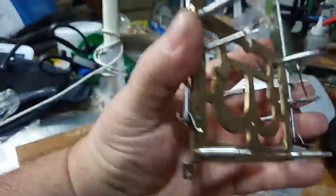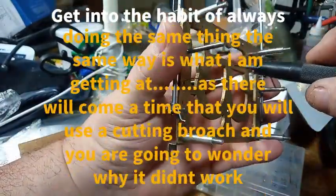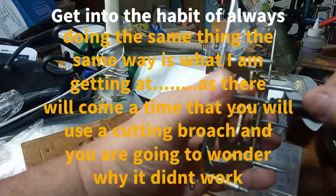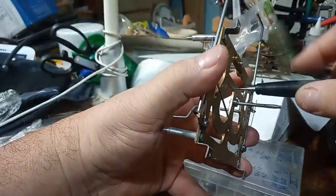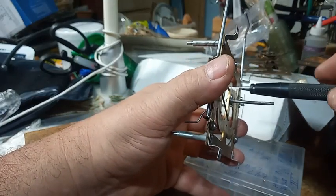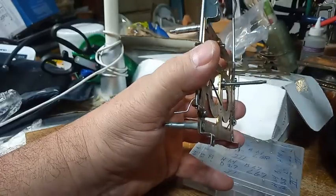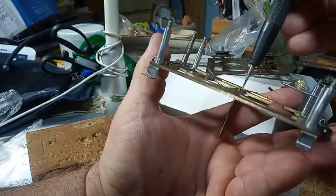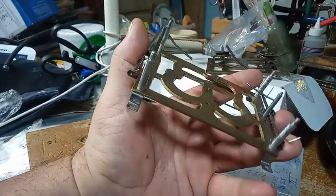And what I want to mention is I put my bushings in from the inside. So you want to ream from the inside. The only reason I'm showing you this is so you can get reference from this posting here to the tool, to see that it's an equal amount in distance away to help you with that reference. Again, the tool has to be straight up and down with the plates in all directions, or your hole is going to be off.